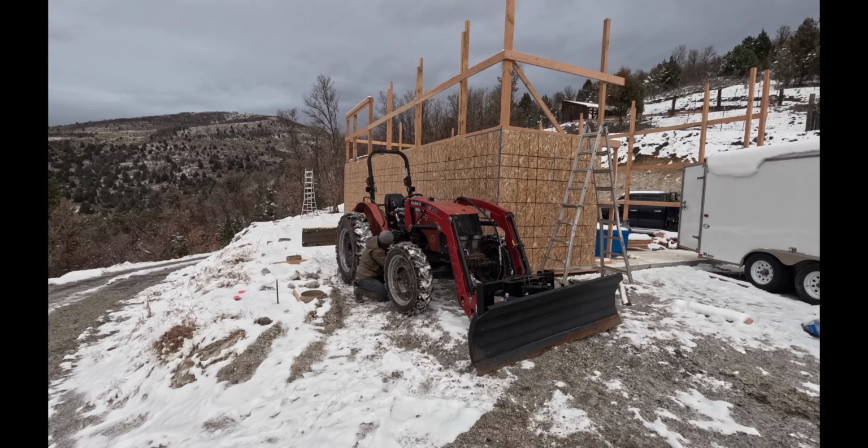The metal siding stands 7/8 of an inch out from the face of the wall. With the plywood on this ledger board, that leaves me 1 inch step out from the wall surface. That should give me a really nice transition and finished edge to go from the metal siding down to the concrete of the porch.